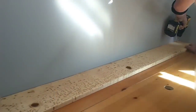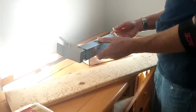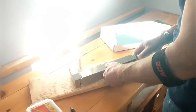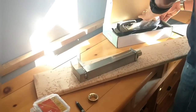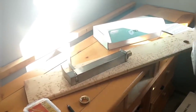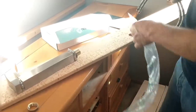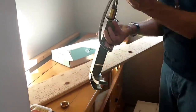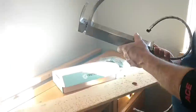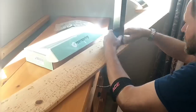The backboard is ready — I've already drilled the hole for the faucet and now I'm pre-drilling the holes to attach it to the backboard and cabinet. Before that, I want to install the faucet. This is a stand-alone single-hole faucet for use with a vessel sink. One feature I searched hard for: I wanted a faucet where when you reach up to turn it off with wet, drippy hands, the water you leave on the knob won't miss the vessel — it needs to drip down, hit the nozzle of the faucet, and then flow into the sink. This particular one had a design for exactly that, so I finally found one that would work.